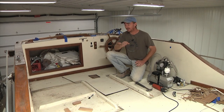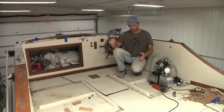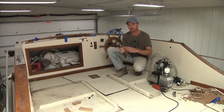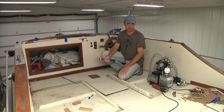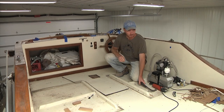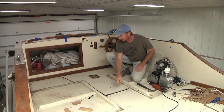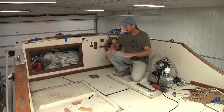The next thing I did was go around with a hammer and tap the entire deck in a pattern, listening to the different sounds. What you're looking for is a nice crisp, high-pitched tap — something that sounds solid. What you don't want to hear is a low-tone hollow thud. I went around and tapped the entire deck, and wherever I could hear that difference in tone I made a little mark. After going over the whole deck, a pattern starts to develop.